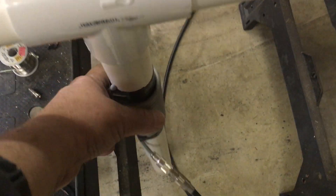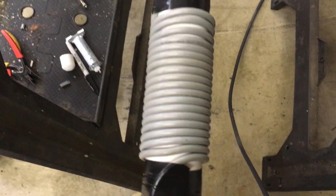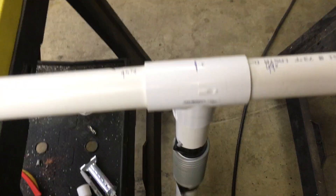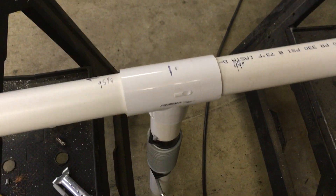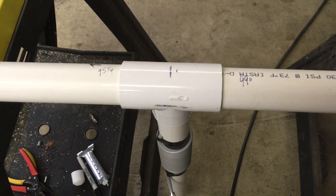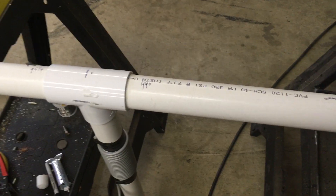I've done these several different ways. This balun is 19 turns of RG-8X. I measured it — it's 8.6 micro-Henrys, which should give you about 1,300 to 1,400 ohms at 27 megahertz, so that should effectively isolate the outside of the RF line. I've also used choke-type baluns internally — not the beaded chokes; I think those are goofy. But an actual wire-wound balun inside, like a W2AU — I've tried those too. I might try a toroid sometime, but that should handle a fair amount of power since 4 watts is the legal limit, right folks?